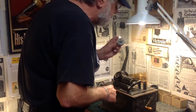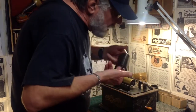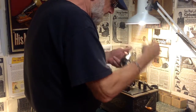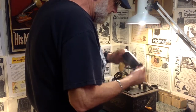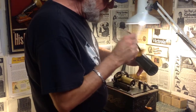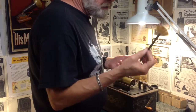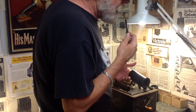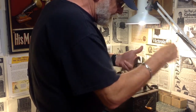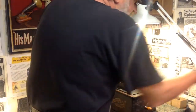Let's pull the recorder off and pull the cylinder off. That's a good loud recording — I can tell just by looking at the grooves. So we brush away our swarf. As always, I always stress this: get as much of that particulate matter out of these freshly cut grooves as you can. Here's a good trick — your swarf brush, breathe on it. That slight bit of moisture takes up every single little strand of that swarf and really sucks it right out of the grooves.